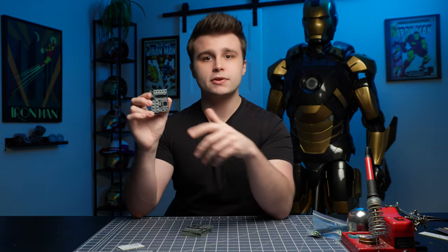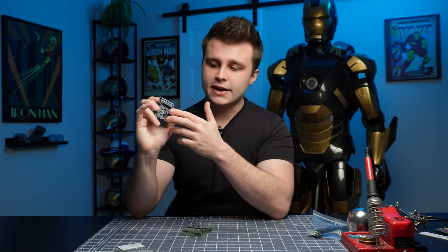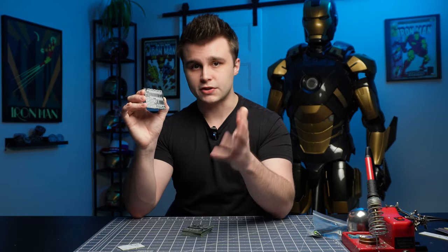One other thing I decided to add, since I'll be using this for the back ailerons, is two outputs to control the smoke machines. On top of that I also added two pins for the eyes, just in case I want to light anything up using the eye function. Lastly, I added a sound module, so you have two connections going from the DF Player to the Arduino from the TX and RX pins for serial communication, two wires going to your speaker, and you need an SD card with the MP3 sounds uploaded to it. And the cherry on top — I added a Mark 46 to the back of the PCB, because coolness improves the effectiveness of a PCB by at least 10%.